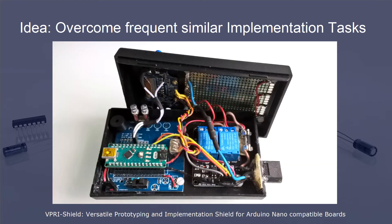And here you see the implementation of a device. As you can see in the LED area, not all LEDs are implemented. The shield is cut into half because the custom area is not needed. The advantages are obvious: you have very tidy wiring. For frequently used elements like LEDs, you can rely on standard hardware circuitry and standard code snippets. Finally, you can focus all your energy on the main functionality of the device.